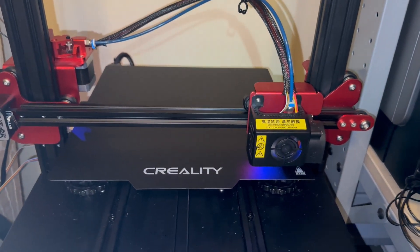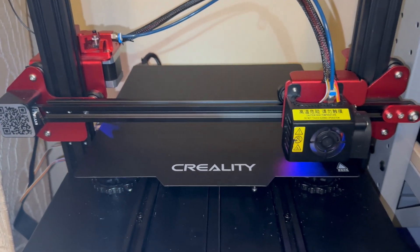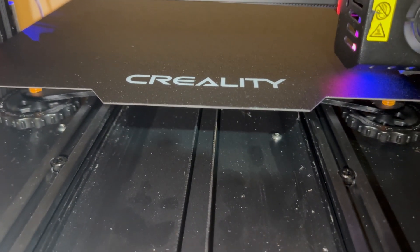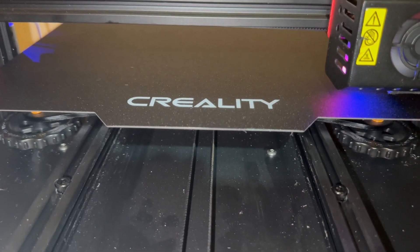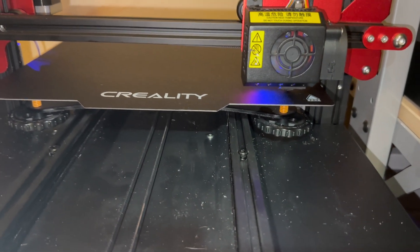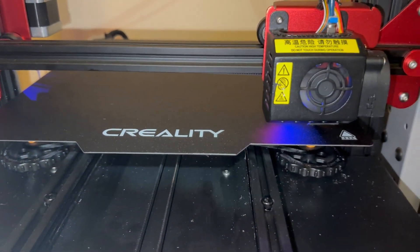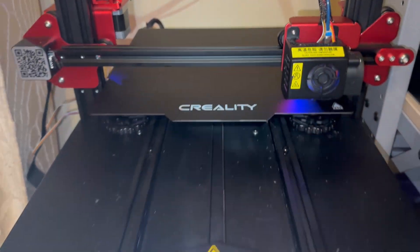One very important thing I forgot to mention: you should re-align your printer because this mat is substantially thinner than either the aluminum or glass mat. The glass or aluminum mat are about an eighth of an inch higher, so you need to re-align and re-measure your printer before your next print job. Print a small test job just to make sure everything is printing correctly.